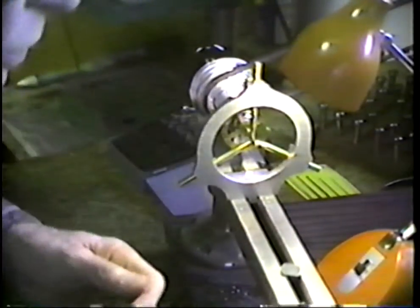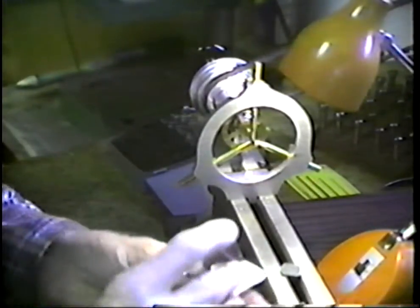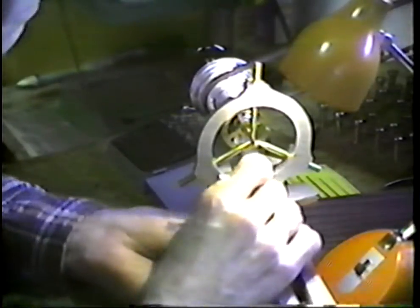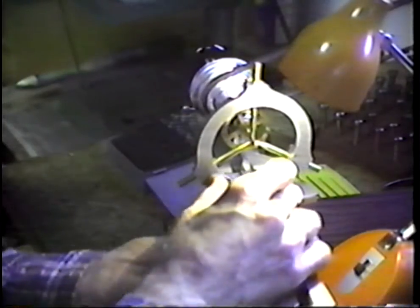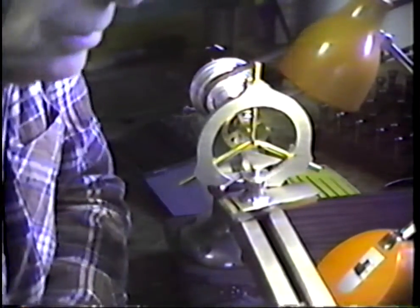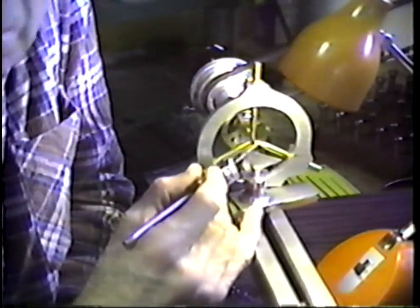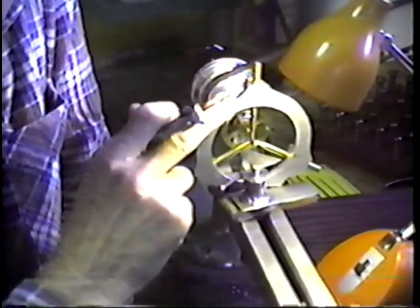and that's the thing that we want to do right here. I want to break the mouth of that hole just ever so slightly with a graver. We'll pull this out, and then we'll start making the pivot. You see that drilling an arbor is not all that big a deal. The real problem is being dead on center. And to be dead on center, you need the steady rest in the lathe to do it.